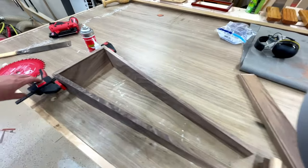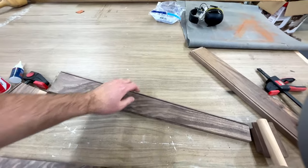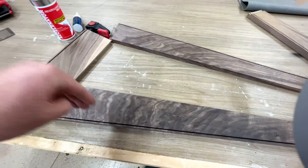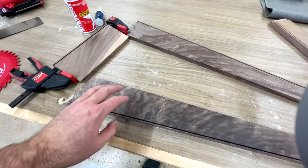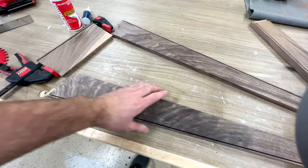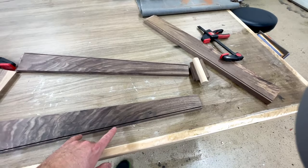The plans say a guy should glue it onto the top and then nail through it. I didn't want to put a veneer tape on top of it the way the plans do — I think the glue is going to be strong enough. But I put it in this little rabbet instead.